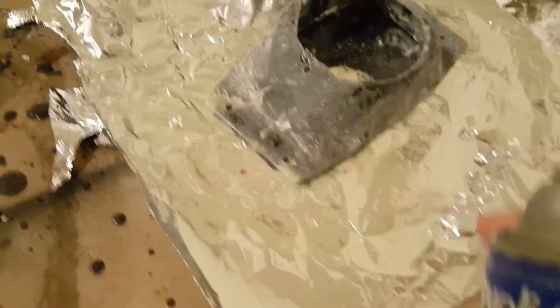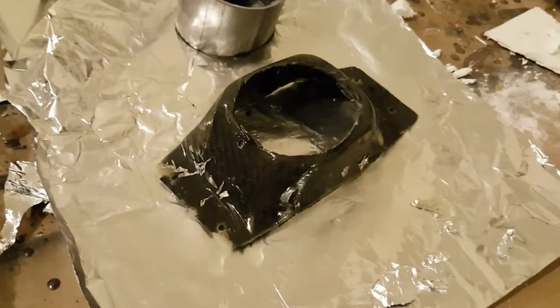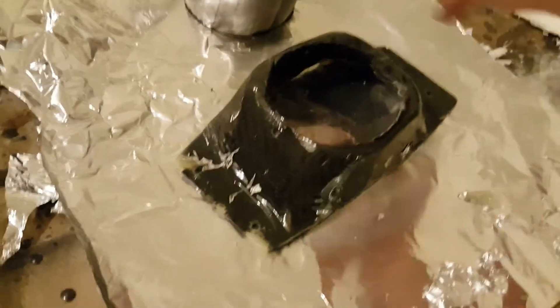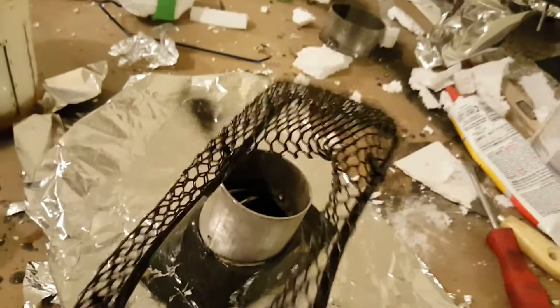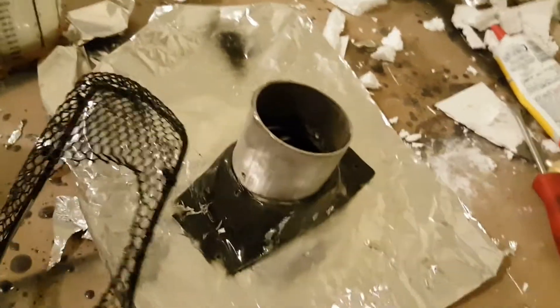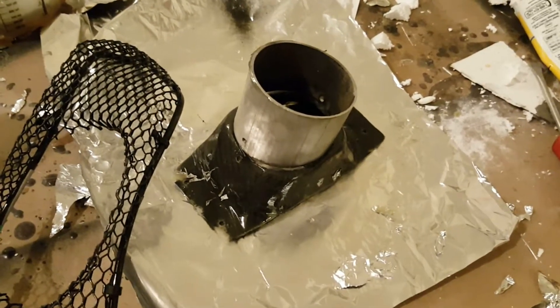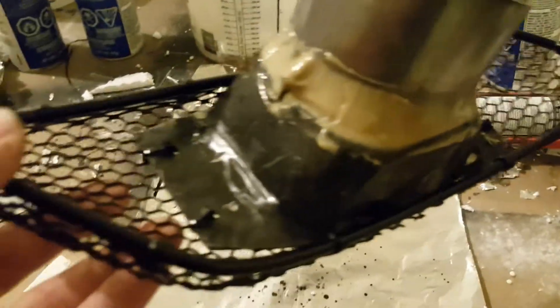It's roughly the shape I wanted. After sanding, the carbon fiber gets a rough texture, but the magic is just spraying some clear coat over it — that brings back the carbon fiber texture. Not the best looking part, but I made it in a hurry. This is pretty much the quickest carbon fiber part you can make, and it's the right size and everything — it will work. This only took me less than a day, including the 12-hour drying time.